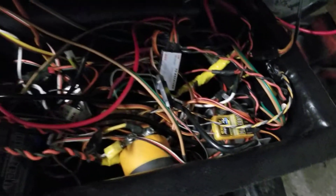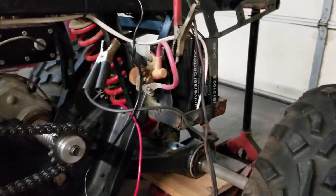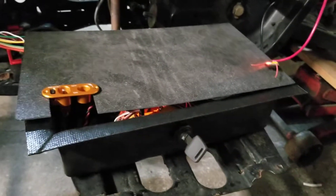I've remade my box — it's still a rat's nest in there and I'm really not too worried about it. This isn't an airplane, it's staying on the ground, and it all works, so it's not going to be a problem. We have a satellite receiver on there too for a little bit of extra redundancy. We're powering the receiver with a LiFe 6.6-volt battery, and the rest runs off the main battery which is a 12-volt 10 amp-hour AGM — like a battery backup system battery.